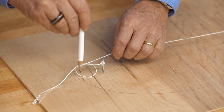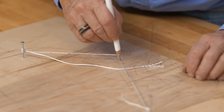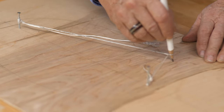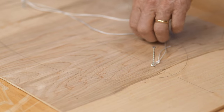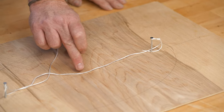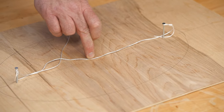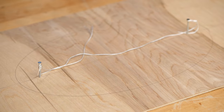I have to go on the other side of the nail, bring it around, keep going — mirror image on that side — right around until we meet up with that one. Check that out. And there you have an ellipse drawn with two nails and a string. What you did was you decided what size ellipse you wanted — how far from the center to the edge on the shorter length — and once you get that, everything else draws itself.